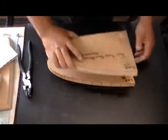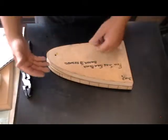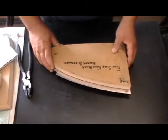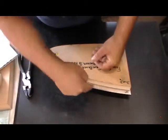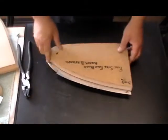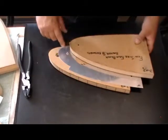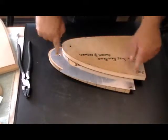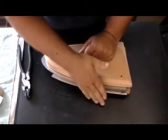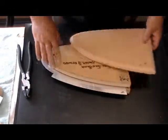The next thing I had to make was another set of tools to form the rib. You've got the full-size form block and the 1-1/8 backer. Basically you sandwich the material between them and use a mallet to drive over the flange. First problem was I couldn't get down in there to set the radius of the flange because of the block, so I made yet another tool. I used my 1-1/8 reduced for this tool, and I made a backer that I 45'd on the router table to give some relief so I could get the hammer down in there without hanging up on the edge. That worked pretty good.